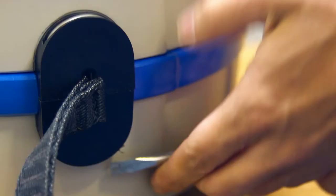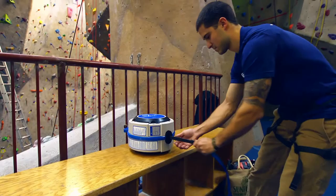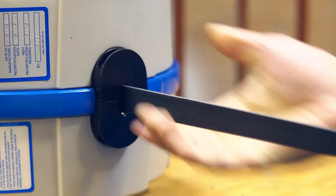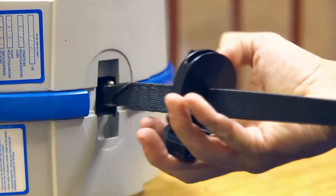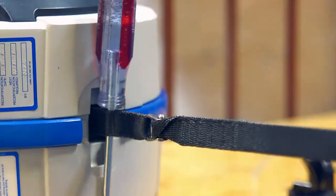To conduct the six-month inspection, remove the nozzle pin from the nozzle. Pull out the complete webbing line, including the drum lead. Place a suitable pin through the loop in the drum lead above the joining link — this will prevent the webbing from retracting back into the unit.